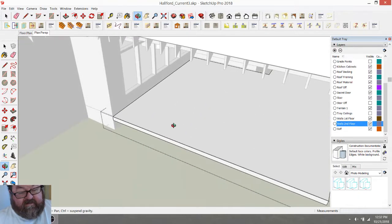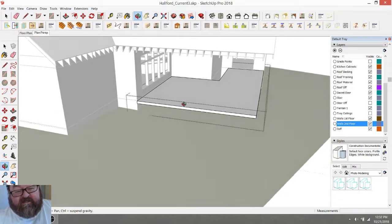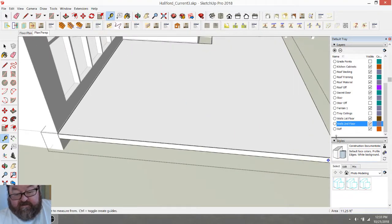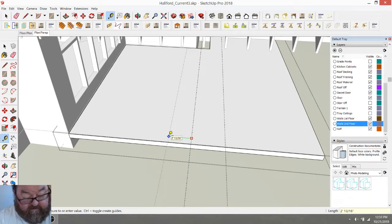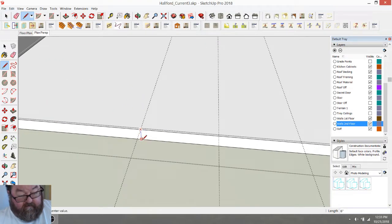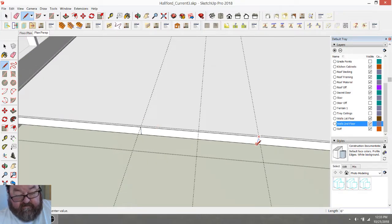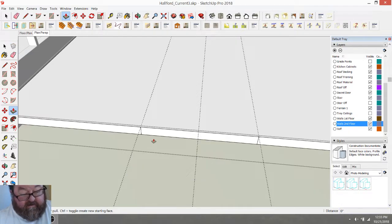The other thing we're going to have here is a fireplace that is, I would say, centered on here. So I'm just going to offset the slab to remind myself there is a center here somewhere. There it is. And that's probably going to be about 6 feet, I would say, at least, for the scale of this. So what we're doing is just sort of schematic design. This is going to come out at least, I would say, 3 feet. Well, maybe not that far, maybe 30 inches.